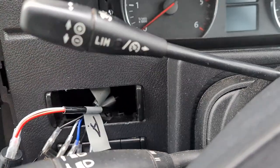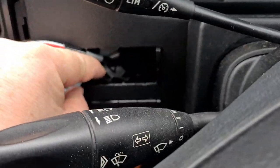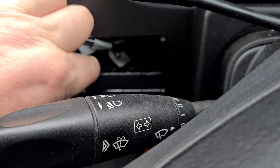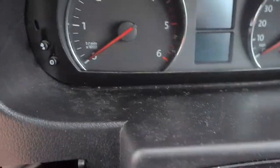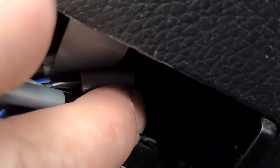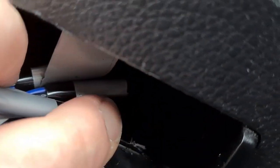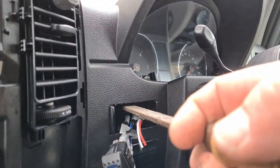It's about 12–15mm deep. Once you've got them out it's then just a matter — we have a rough aluminium file and we just take that lip down. There's a tiny little lip — we just need to take it off so we file it flat. This is an aluminium file and it's perfect for knocking back plastic.